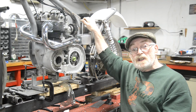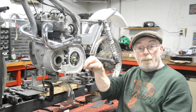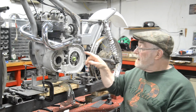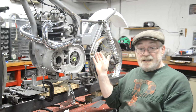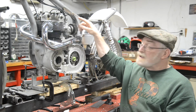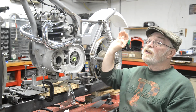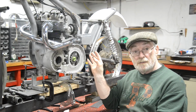Because you'll see it spurts out. It doesn't shoot out. It goes blip, blip, blip, like that, with a little bit of air in between as the pump's catching up on what it pumps. So that line has no pressure in it. And obviously this scavenge line up to there has virtually no pressure in it at all. So those fittings are fine for their purpose.